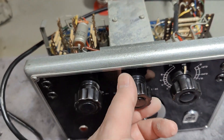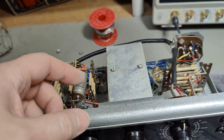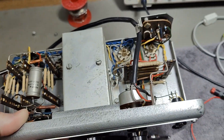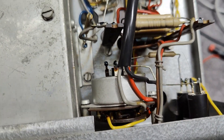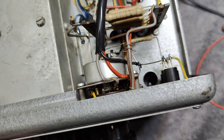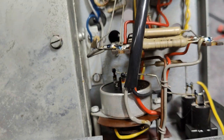There are three different frequency ranges: 20 to 200 Hz, 200 to 2k, and 2k to 20k Hz. I think it is some sort of a carousel switch - I'm definitely going to open this one and have a look. This main cable here could be original because in the old days they had really odd color codes: black could be chassis, but I've also seen red wire as chassis. In the 60s and 70s, red wire was actually earth and chassis protection - quite confusing in an instrument from 1955.